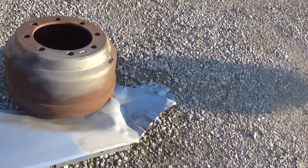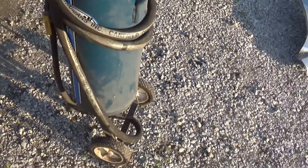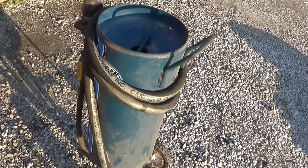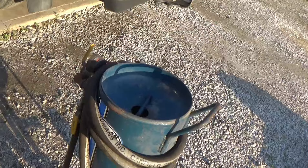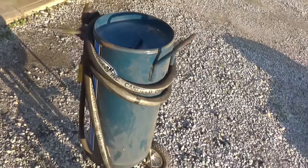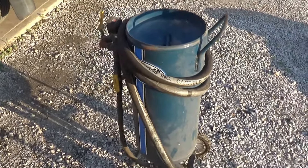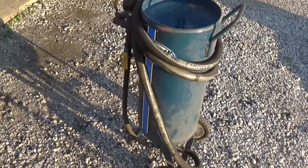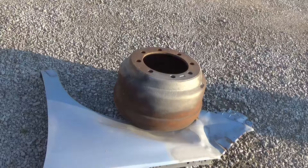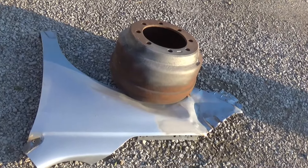The pot blaster is quite a bit faster, but it's a lot messier and a lot noisier because the air compressor is running the whole time. Most people at home do not have anywhere near that much air — you need a good 18 to 20 CFM. It'd be hammering the whole time, you'd have to stop and let it catch up, then after about 10 minutes stop and let the compressor cool down unless you've got a big setup with 50 cubic feet of air. It is a lot faster, but your sand is not contained — it's all over the place, all over me too. You have to wear breathing protection.